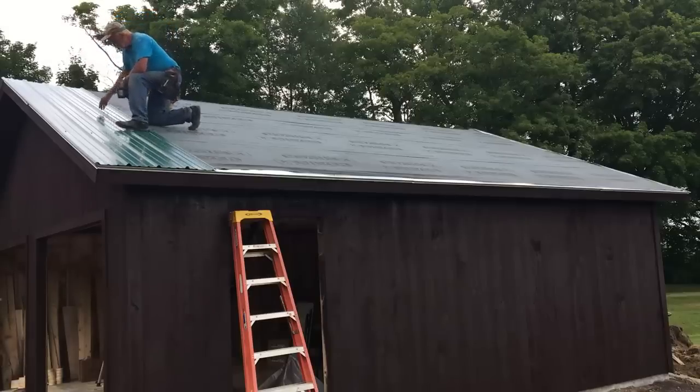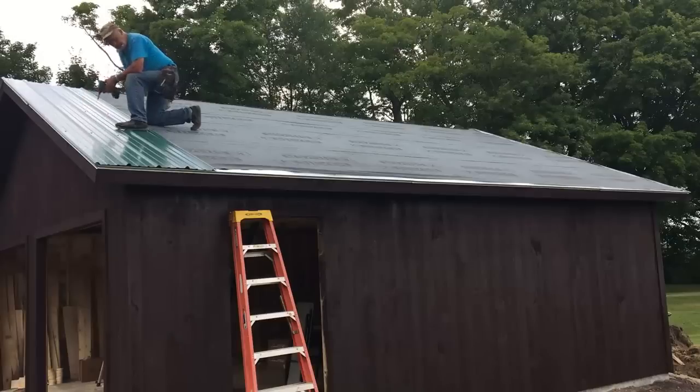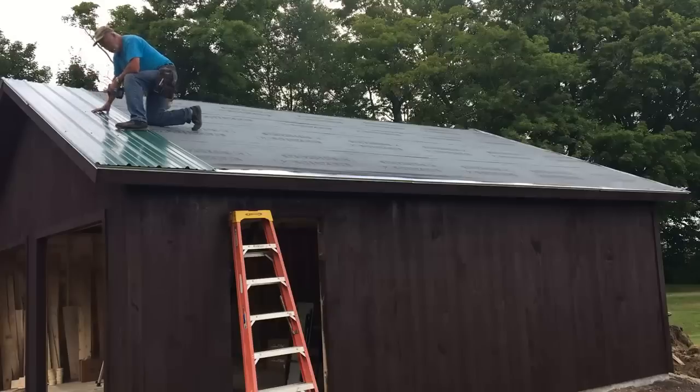Little pointy conversation. I put screws every 4 feet. Most people put them every 2 feet or 16 inches, or even, it's just a lot. Every screw you put in hinders snow from coming off. I've done 500 roofs this way and never lost a sheet. And we've gotten some high winds. High winds around here is like 40 miles an hour, so, you know, we don't get that very often. But that's what I do because I really like the snow to be able to come off.